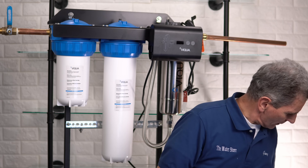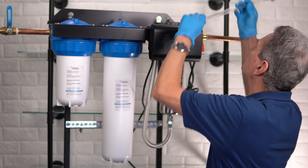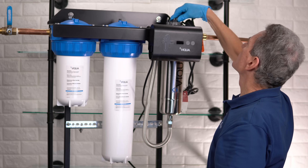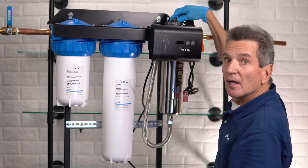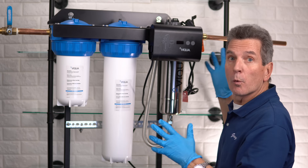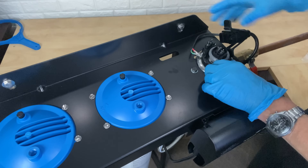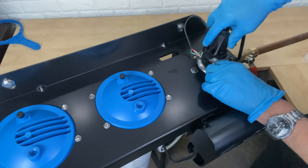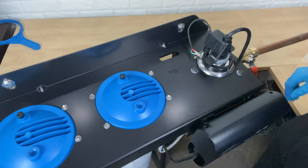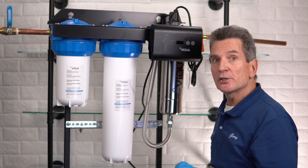Grab the lamp and — again handling it with gloves or a clean cloth — feed the lamp in. When you tighten the lamp it goes in about a turn and a half and then you'll feel a hard stop. That's okay; the water is sealed by the sleeve bolt and the quartz sleeve, not by the lamp. Then move the jumper around so it lines up with the pins, push it down, and you need to hear it snap into place on both sides. I always push down the tabs on both sides just to make sure.